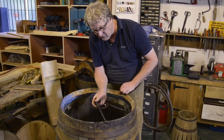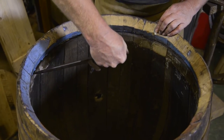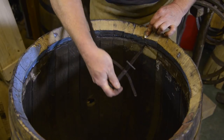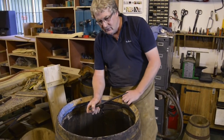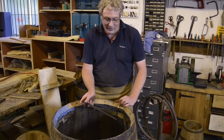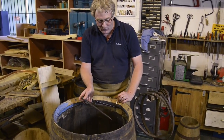We step out: one, two, three, four, five, six. On the sixth step, we want to come back to exactly the same spot where we started. There are six 60-degree equilateral triangles in a complete circle, and that's why it's six steps. Six sixes is thirty-six, so it's quite easy to remember. As we showed earlier, we've done the sizing of the head — the stepping out with the compass.